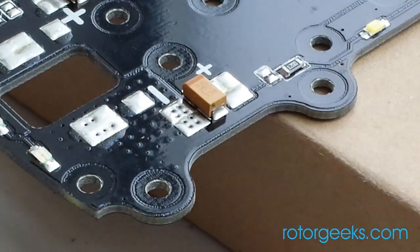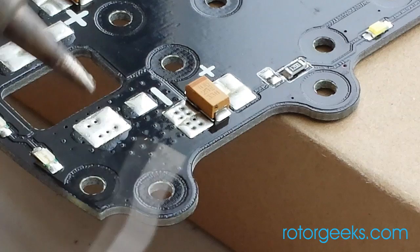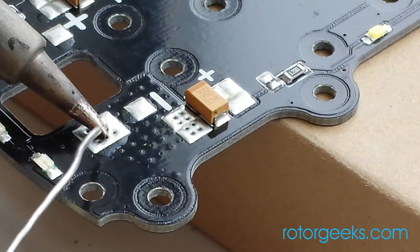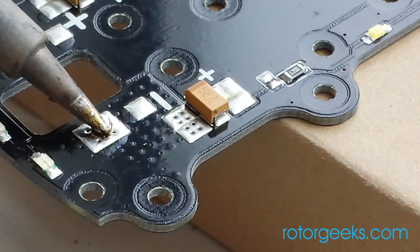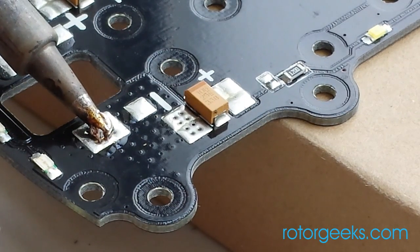Go on to one of the pads — it does take a little bit to heat it up. Just let that solder on the tip heat the pad until it flows. You'll see that if you start putting solder on right away, it won't stick — it'll just bead on the end of the iron. But if you let it eventually heat up that whole pad, things will flow nicely.